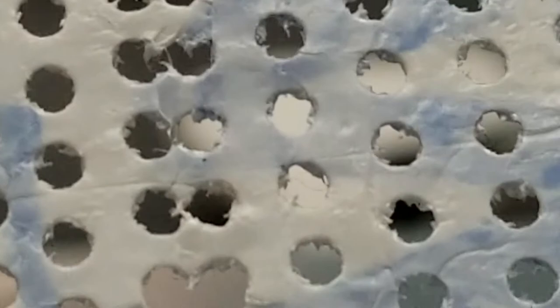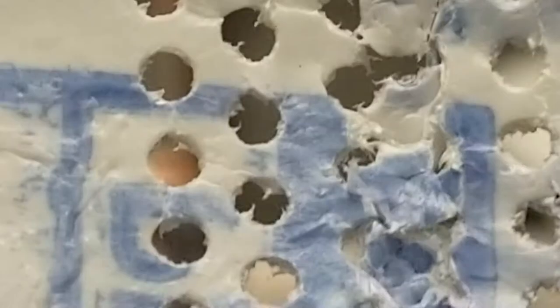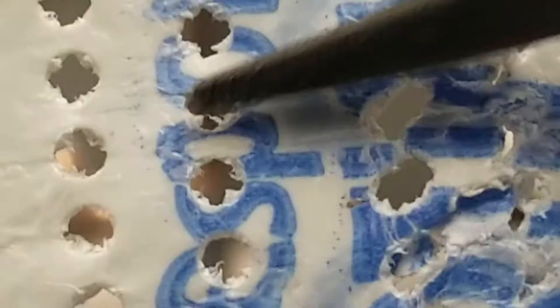Let me find some good examples — here's a nice clean round hole, a perfect hole. This one has a little bit of fuzz, probably because of bad plastic. Here's one still with two tips sticking into the middle — this needle isn't cutting perfectly. Here's a good series showing holes that aren't round; they have shoulders on each side. The nice clean hole we want is over here. These types of holes indicate the needle isn't sharp or the plastic is bad.